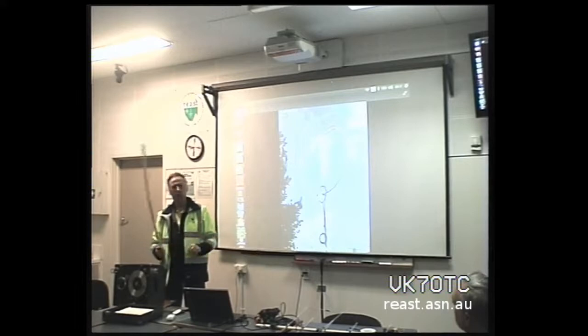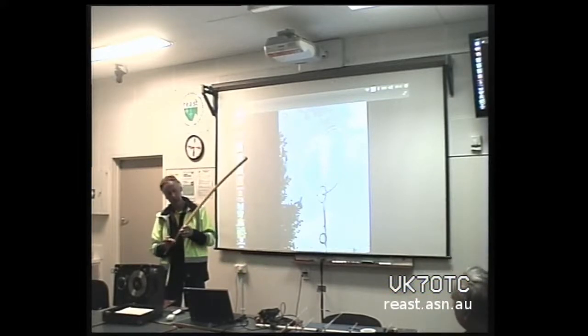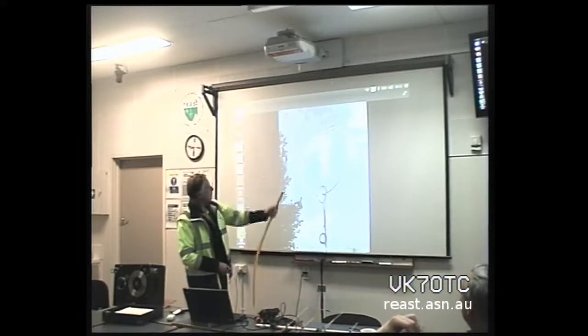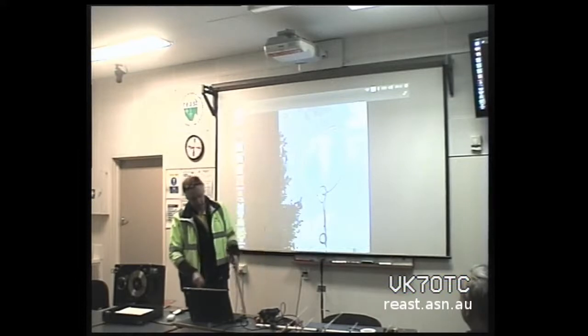For a relatively small price, the cost of a length of that, about $25 or $30, these are Bunnings prices by the way, $20 for a metre of this, which is quite dear, but for under $50 you can make a magnetic loop antenna using a trombone arrangement. This particular one, the trombone is inside the PVC pipe, and I've just used half inch heliax as my matching loop.